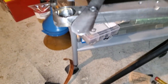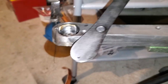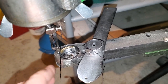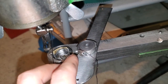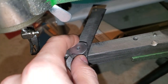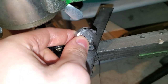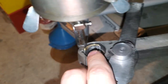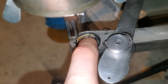Not the bottom thread — the upper thread. Because the sewing machine is supposed to catch the top thread on the hook here, make a loop, and pass the loop under the shuttle. And my problem was the thread kept going under this shuttle carrier thing.